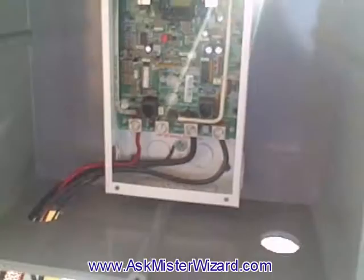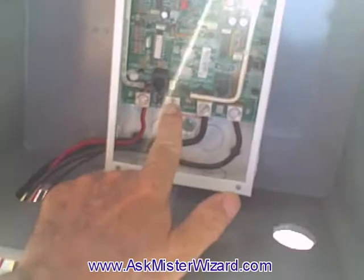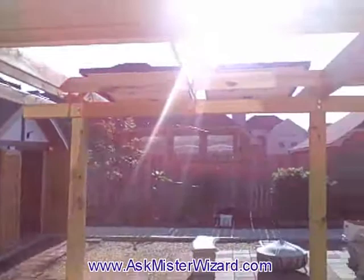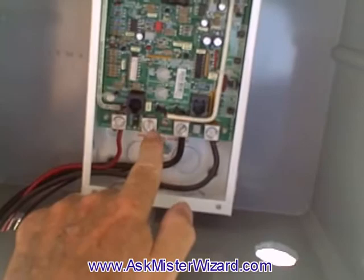That was easy. One last circuit remains. I need to connect the positive PV, or photovoltaic, load terminal all the way through this fuse and then back up through a long wire to the positive terminal of this solar panel over here. I'm not going to do this while the sun is shining — I'll make that last connection in the dark. But I can begin with the part that goes to the fuse, running a wire from the positive photovoltaic source terminal on my charge controller down to my fuse right here.